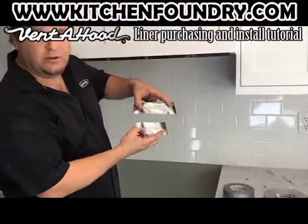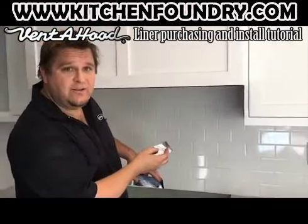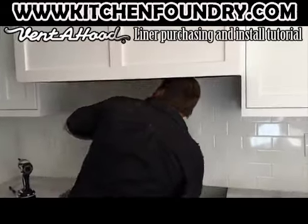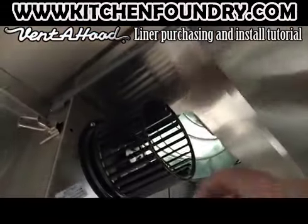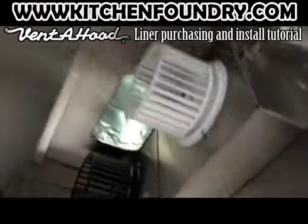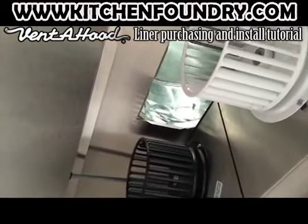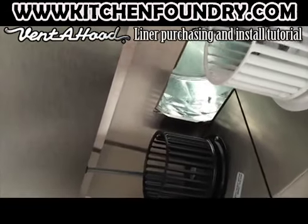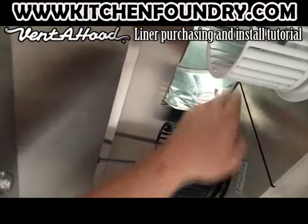As I mentioned in earlier steps, I can cut small pieces of metal tape, and I can reach from underneath this hood up inside this vent pipe to seal various spots of the ducting from down below, as far as my arm can reach up into that space. This can also be done in segments from the attic as you build the duct pipe up to the ceiling line, but a good piece of metal tape here is sealing the bottom of the duct pipe, the trunk of the duct pipe, into this collar.